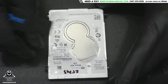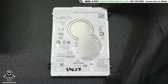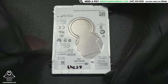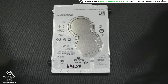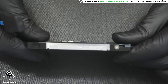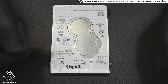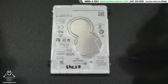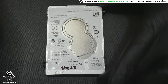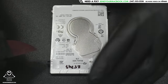The way this drive is made, it uses this film around it. The family name for this hard drive is Rosewood Seagate — it's one of the slim drives. A lot of data recovery professionals don't like working on these drives. They have issues with the heads a lot of the time even after replacement, where the heads work for four or five hours and then crash.